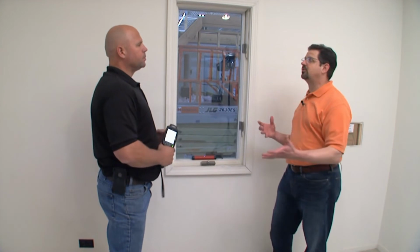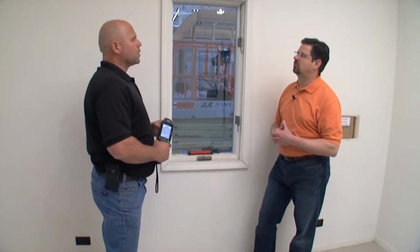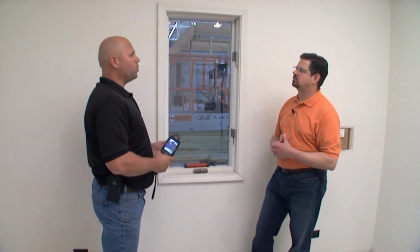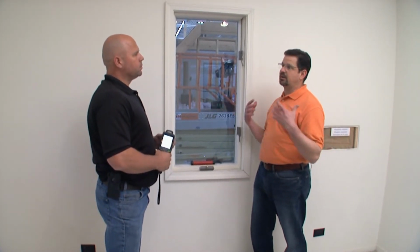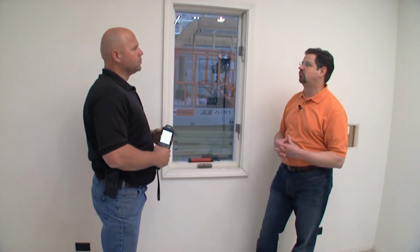Okay, so it's a multi-step process. So it's not just something you do at the end. This is done during the phases of construction. Correct. Once we have the finishes on there, now we're talking about destructive testing, and then we're going to have to really narrow it down. If I don't meet my numbers, I'm going to have to start tearing apart my building and using a lot of caulk, just trying to find little holes where I might have found a big hole with my smoke or infrared camera. Sure. But basically at the end, it's creating a tight environment and envelope for the building structure.